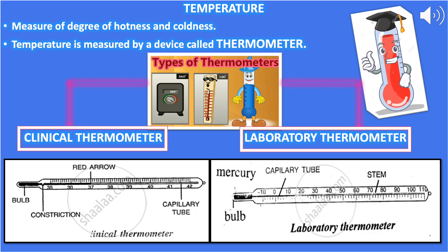The laboratory thermometer lacks a kink. It consists of a very thin capillary tube of glass surrounded by thick supportive glass walls. The upper end of the capillary is closed after evacuation and the lower end is drawn into a delicate bulb shape. The laboratory thermometer is generally used to measure temperatures ranging from −10°C to 110°C. The stem has horizontal markings called calibrations to read the temperature.